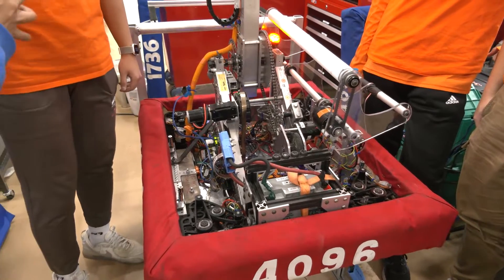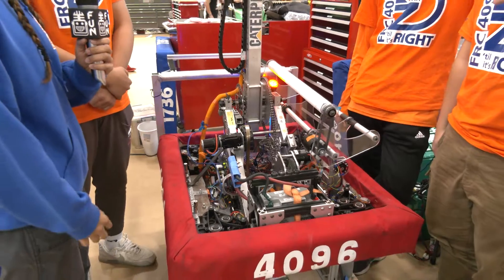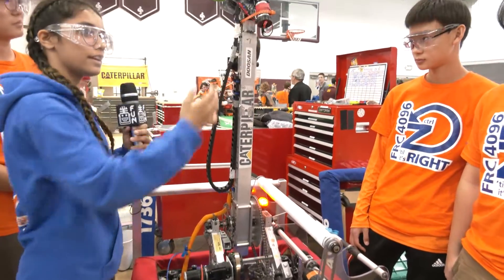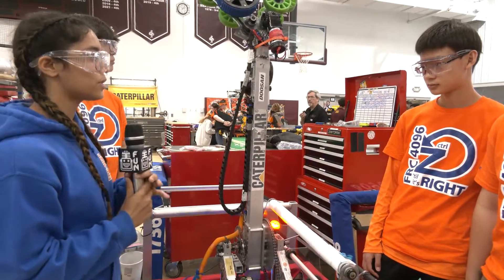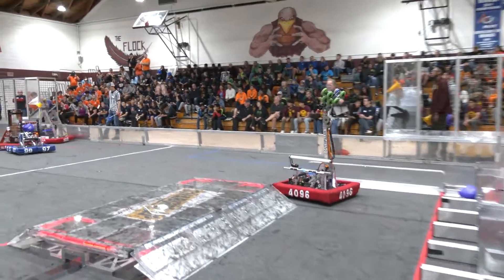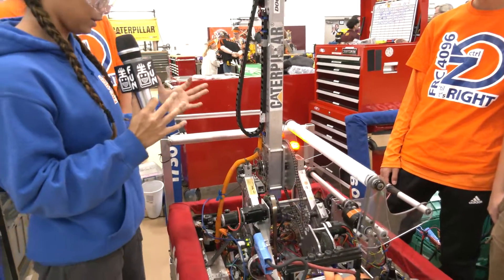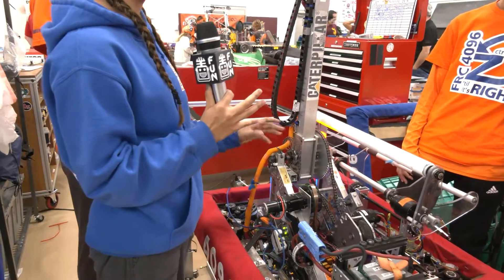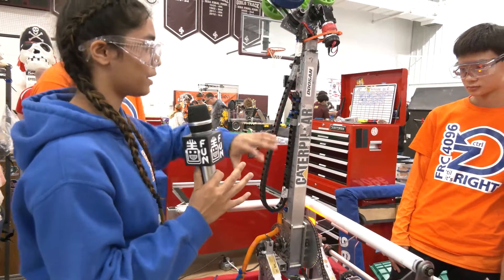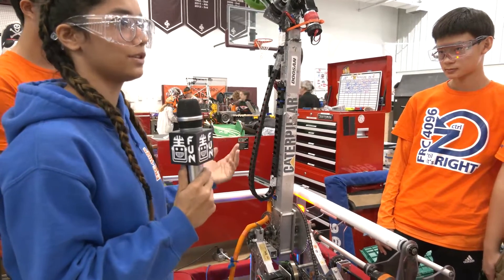Lisa, let's talk about your arm on your robot. I think a big showpiece has been your consistency throughout matches. So our arm is composed of two sections — it makes up a telescoping arm, and we use a rack and pinion system which uses little holes and a gear to have our arm extend. It's supported by two triangle bases, and it's a really robust system. Everything is very low and centered to gravity, and everything is bottom heavy. Because we're swinging our arm around, we want to make sure we're not going to be tipping at all — and even if we do tip, we're able to get back up.